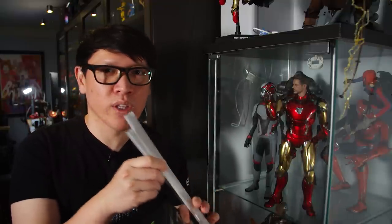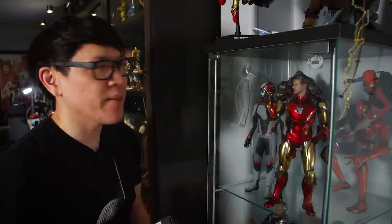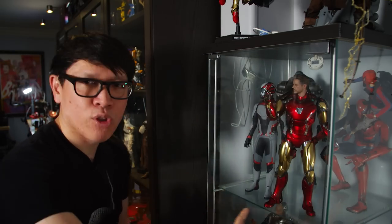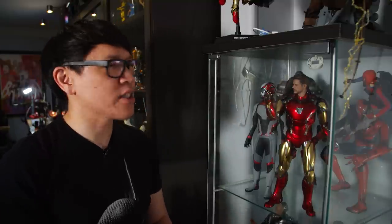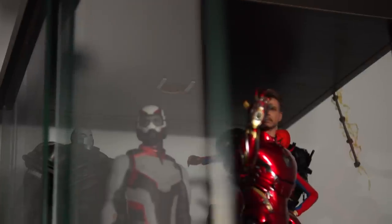You can get these strips in really long rolls — about a meter in length — and cut them to size yourself. I did find a retailer that sells them pre-cut at 12 inches, perfectly fitted for the Detolf, with diffusion included. It's going to require a little bit of soldering and some custom wiring because I want all the LEDs on one power supply. The wires are going to snake their way along the four shelves and find their way to an outlet. Not that difficult a project — all the components I'm using are listed in the description below. Let's head over to the soldering station.